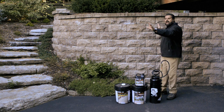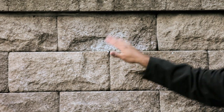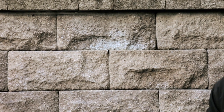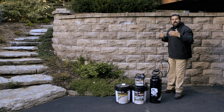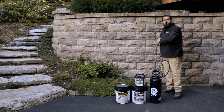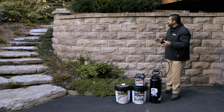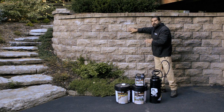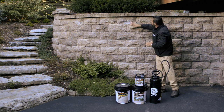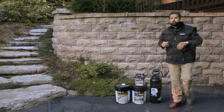When we came out, we saw everything was exactly the way we had designed and built it, but there was a little bit of efflorescence caused by the heavy rains we had early this season, and a little bit of moss and mold buildup on some of the cap. We asked the homeowners if they'd like us to clean and seal the wall — they didn't even know that was an option. So we're coming in with some cleaners and sealers. We're going to use the water-penetrating type, which is going to help resist some of this efflorescence and moss in the future. This job is going to look awesome.